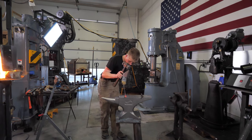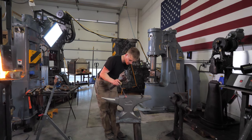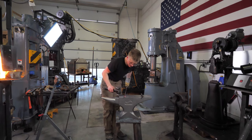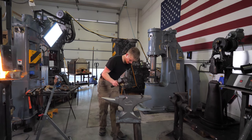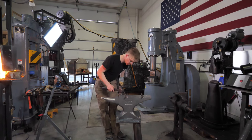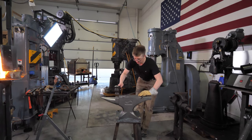I will say my work has oxidized a lot. With all my rambling, I've let it sit in the fire a little longer than it should. And when I turned down the forge a little earlier, I turned it down the lazy way by simply reducing the amount of fuel going in, which gave me an extra oxidizing flame. So, kind of kicking myself for that choice there.